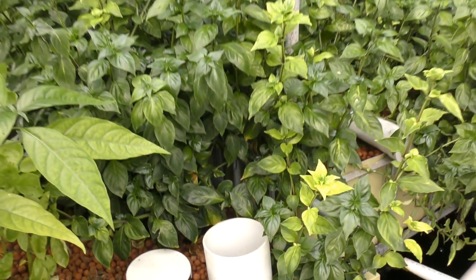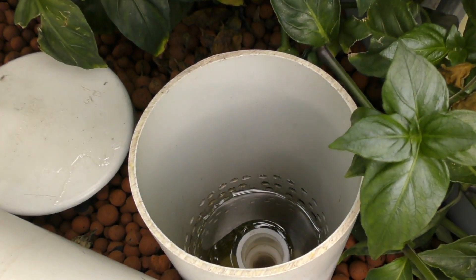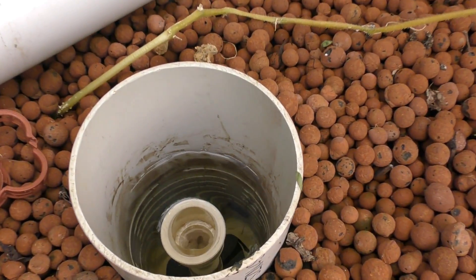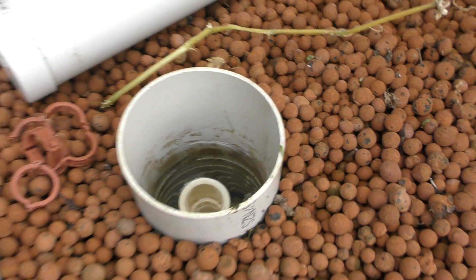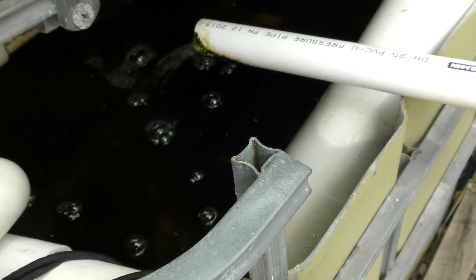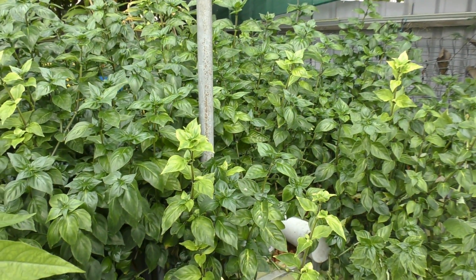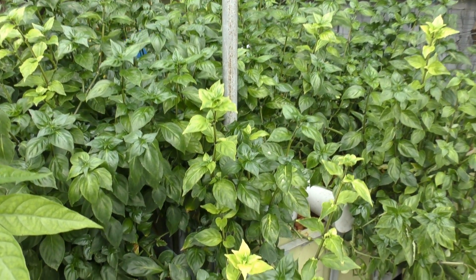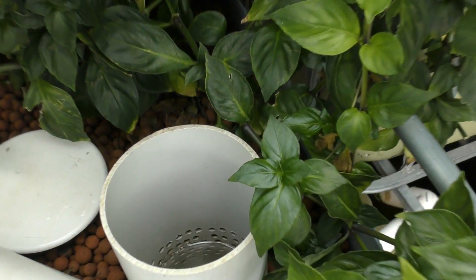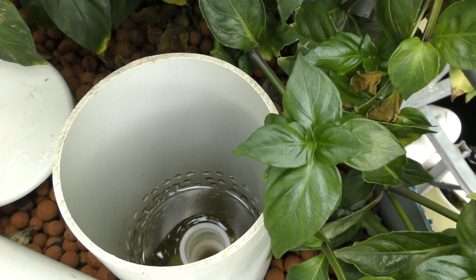The way I'm flushing the salt out of the system is pretty basic. I've taken the bells out of the bell siphons and just let the water fill all the way up to the top of the standpipe. The four IBC beds and the joined barrel system bed are all the same, and I fill up the sump so it's pretty much all at the top. Once that's done I let it circulate until all the water has mingled and there's a constant salt level throughout. Then I pop the bells over the top of the siphons and they slowly overflow the sump tank, and that water is sent out to waste.